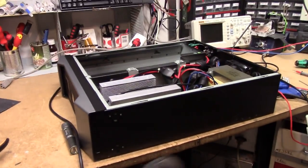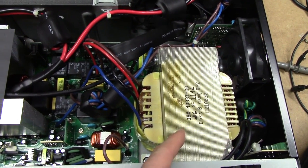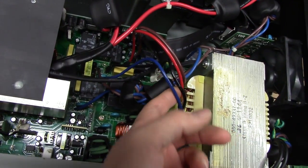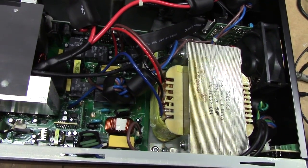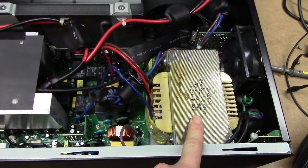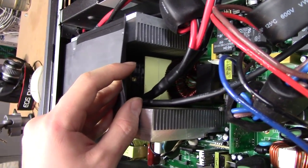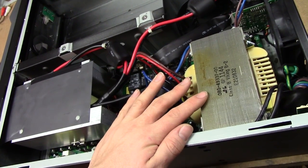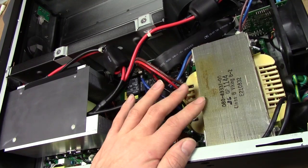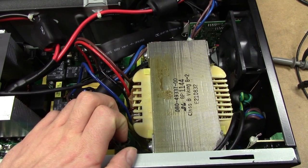This seems to be a pretty okay unit anyway. Oh, but oh dear — you shouldn't trust strangers, because I just measured this thing and it's only got four leads coming out of it, and all of these go together. So this is just an auto-transformer — it's not an isolating transformer. So unless the isolation is achieved in that other component, there's no isolation between primary and secondary, i.e. the battery. Naughty naughty. I was about to measure the output waveform just for kicks to see if it's clean, but I'm going to have to reconsider and take another approach.